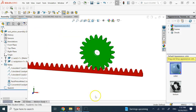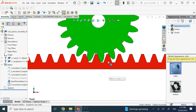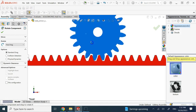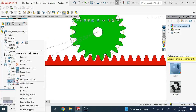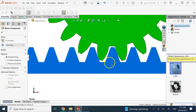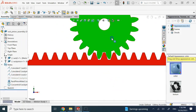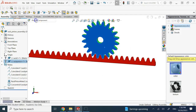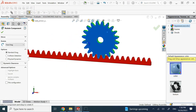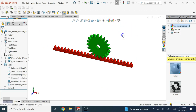Now the distance is defined once correctly, and the gear should spin in place. Let's check — yes, it spins in place. There is some interference though, so temporarily deactivate the gear constraint, move the rack a little to clear the interference, then reactivate it. Now rotate the pinion — the pinion stays fixed and only the rack moves left and right. This is proper assembly of a rack and pinion.